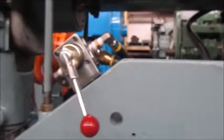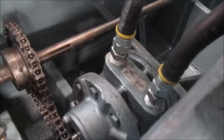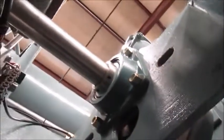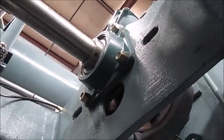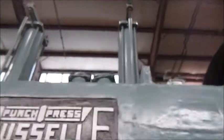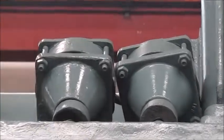It's been all rebuilt. This is a brand new air valve for the ram adjust. And this is a brand new ram adjust motor — it's an air motor. All the bearings on the back shaft have also been replaced; I believe there are three of those, and they've all been replaced. Counterbalances have been rebuilt. These air brake cylinders here have been rebuilt.